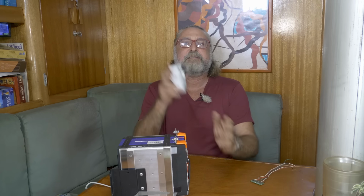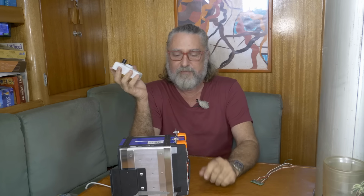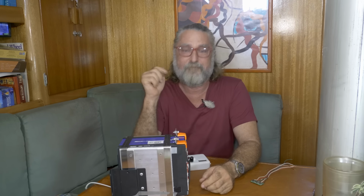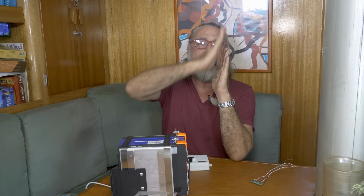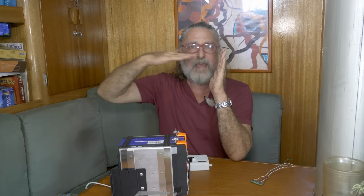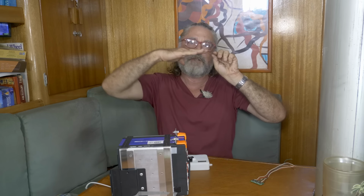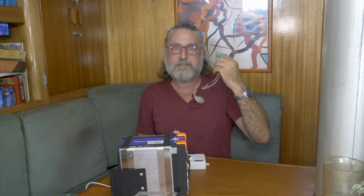And then the other thing is, if you use a bank manager to manage your lithium battery, and you should, of course, not just because I make them, it's actually a very, very good product for taking care of lithium. It doesn't really let the lithium come out of that flat area up into the hockey stick. It can sense the batteries are fully charged just before they start doing that. It's really good at that. The downside is you wouldn't be exercising your balancer.